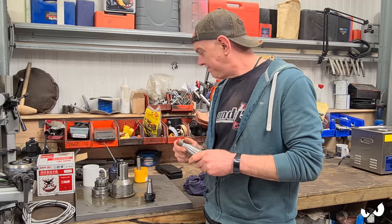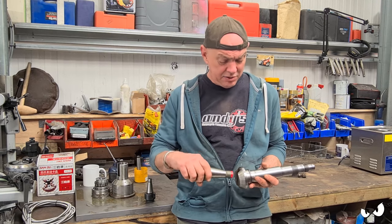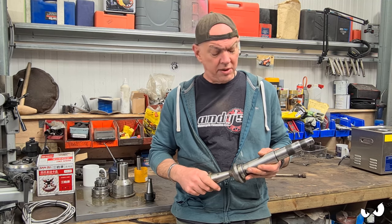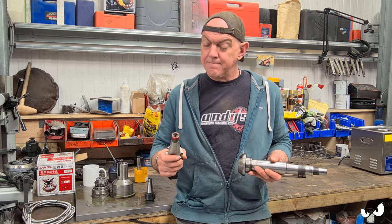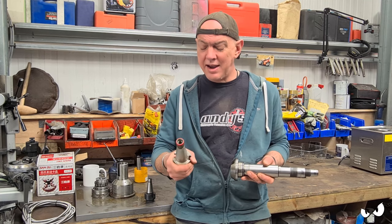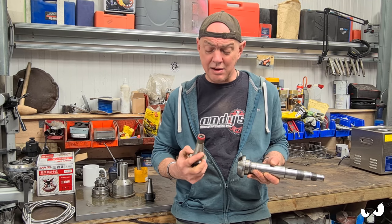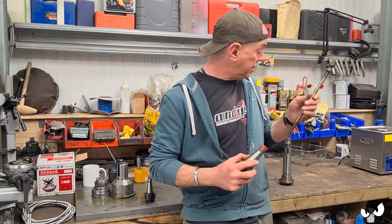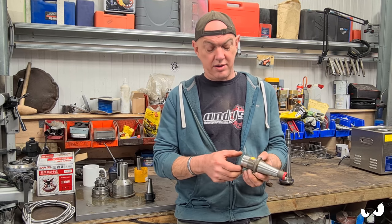But ultimately, it's got to have a taper in it. All the tooling on the milling machines and stuff that I've seen has a taper. It needs to have a taper that's the same as whatever I'm sticking in it. So yes, I get you've got a drawbar through it that you have to twat to get it out, and essentially you're knocking bearings and stuff like that. And there are things that have got like an auto lock thing that will miss that. So I am going to have to use a taper. But they're all basically the same. It's just how you engage it for rotation and how you get the thing in and out. I don't really care what size the drawbar is. Although that one might even fit. No, it doesn't. I need to get another one. But it will work.